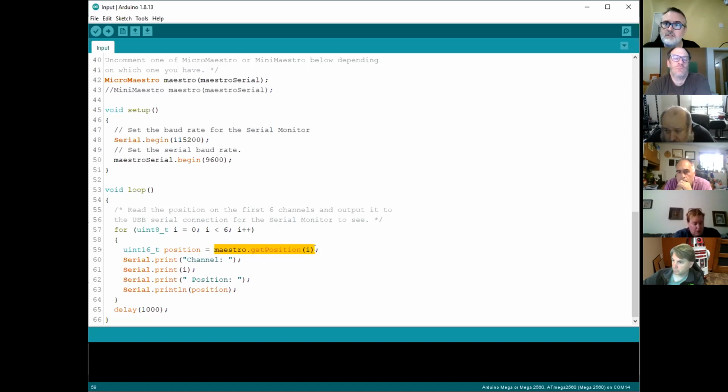So to do what you mentioned, Scott, there's kind of a rough way, which is to run the animation and run a slight timer, and then after a second and a half, which you've worked out that the animation roughly runs, it will then run a sound. But that's not getting any feedback from the Maestro. The other way is to run the animation, set a state saying it's running an animation, and then in the background, check to see if that script has stopped. When the script has stopped, then play the sound. So that's a couple of different ways of doing that.